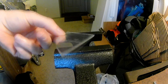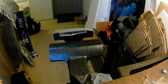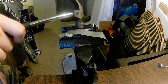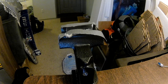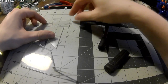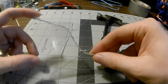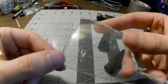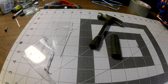Now on to the topic of acrylic versus polycarbonate. This is a small sample of acrylic — you can already see how jagged it is from breaking. I've taken a hammer to it, and that's what happens with a gentle blow. Now this is a piece of polycarbonate from the visor — same situation, same hammer — and this is what happens. Acrylic, if impacted with high forces, breaks in a crystalline manner, while polycarb just gets some dents and scratches — and you can see what happened to the hammer when I tried to demonstrate this. If you're expecting to get hit in the face or plan to do super soldier things, polycarb would be the choice for you.